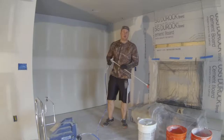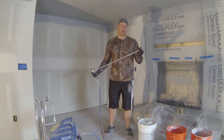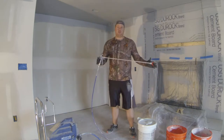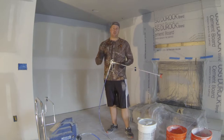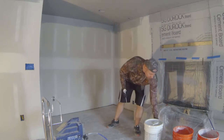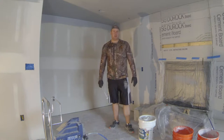For doing all the painting I'm going to be using two different extensions and two different tip sizes. I'm going to do all the walls first and then switch out to a smaller setup. This is a 30-inch gun extension with the 517 tip — the same we used for the ceiling. This will allow me to reach all the way from top to bottom and get a good pattern without having to bend over. For the doors and closets and other hard-to-reach areas, I'll switch to the 10-inch extension with a smaller tip size and a smaller fan pattern. I'm going to mix up my primer — using the Bullseye 1-2-3 primer this time for all the walls, doors, and door jams. I'll mix that up, clean out my gun, prime it, and we'll get to painting.